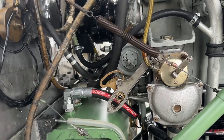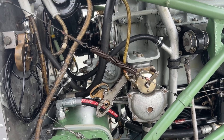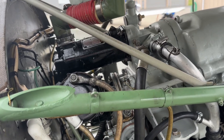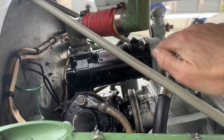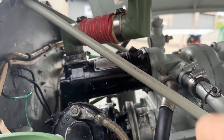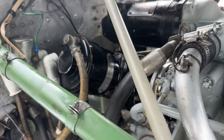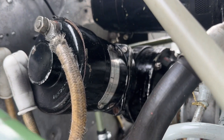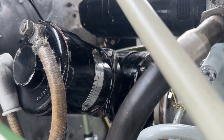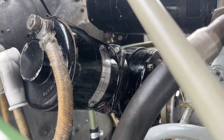Other things around the back — it's a similar engine to the Tiger Moth, and the big difference is the number of accessories added to this engine. Going from the top, we've got the generator, which makes a bit of heat when it's doing its work, so it has a cooling inlet with air that runs through the assembly to keep it cool. Coming down, a little bit tricky to see, you've got the starter, which is actually at a 90-degree angle to the back of the engine, where it goes in via a gear drive and a clutch to start the engine.